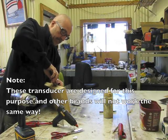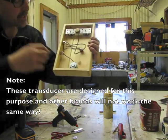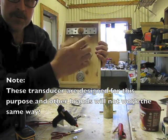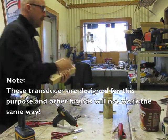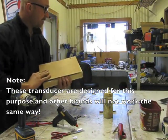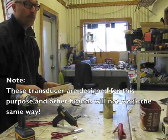There are many different ways of doing this — this is just one way, I'm showing you it as an example. The bass transducer sits on the heel there, the transformer has been glued in place to keep it safe, and the jack plug is now coming through the hole. If you want, you can cut a little bit of ply and make a nice lid for the back to keep it all secure. Since it's only a demo, I'm not going to bother.